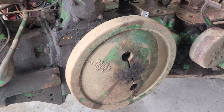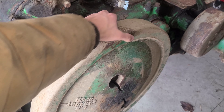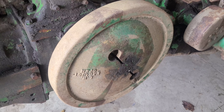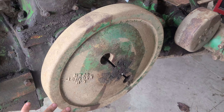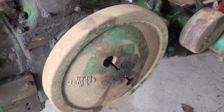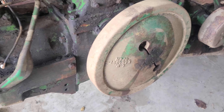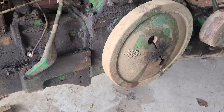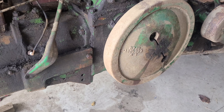The number one thing I should have started with: is the tractor free? When I first looked at this tractor, I was amazed — after sitting for ten years undercover, it was totally free. It spins all the way over, and not only that, it has compression on both cylinders. As I spin it over I can feel compression building in both the first and second cylinders. If you don't have compression, it could be various reasons — maybe a stuck valve.